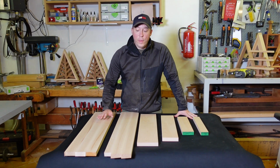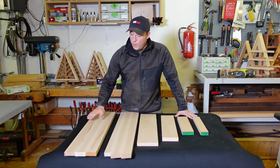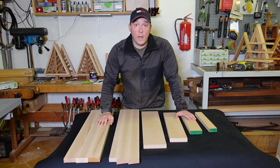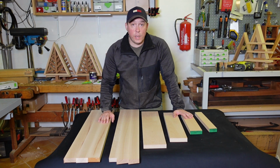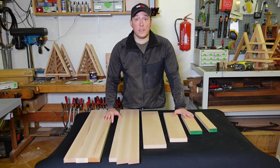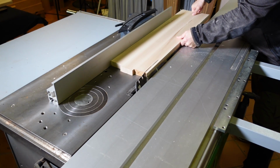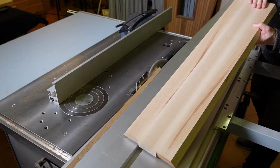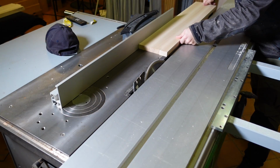They're all cut into width, and the first thing we'll do is make a 30-degree cut on both sides, looking like this. So I'll use my circular saw and I'll be building a minimum of 2 pieces. I don't want to use the drop saw for this because I think there will be way too many cuts. This is also a great project to use some of your offcuts from your workshop. Bottom part done, and now we'll move on to the next one.